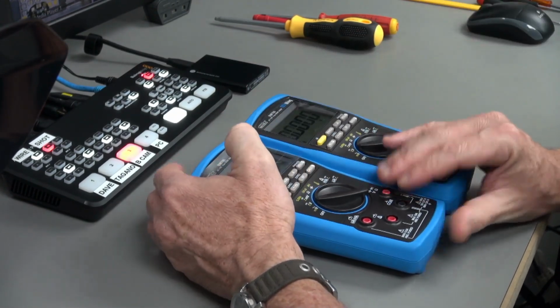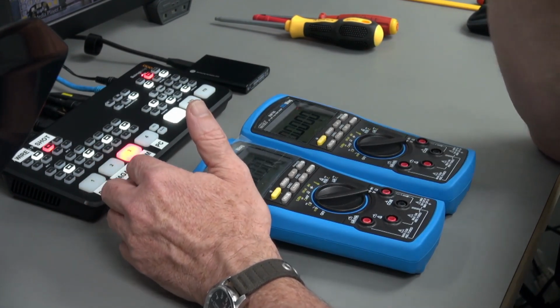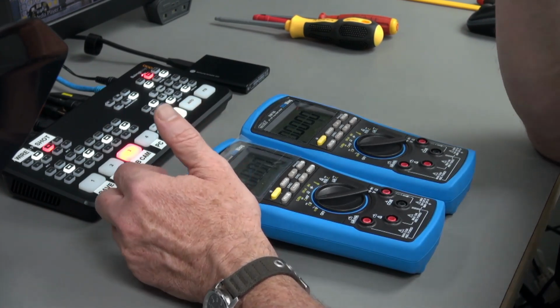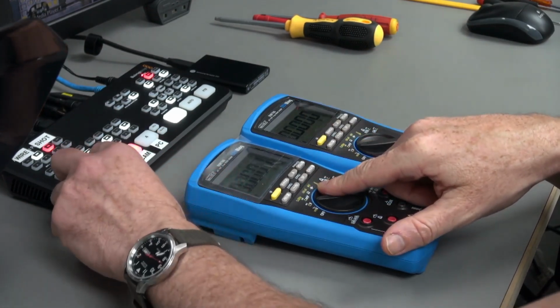I got 2 of them back, but 2 of them had the same fault, apparently, in that it seemed to be something dicky with the switch, perhaps. That's my guess. The symptoms were, this one in particular, you put it in ohms, oh, there we go, forgot to change channel. Put it in ohms diode mode and it would flicker around, and if you move the knob it'd come good and then it would play up and all sorts of things.